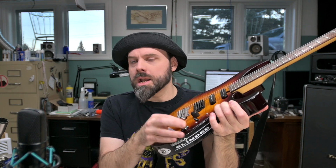I would like to think that Seymour Duncan could program it in the software to pick a spare position, maybe in an advanced settings, and connect that to a switch. It can detect, say, the lack of signal or a ground, right? Maybe that channel just detects that there's a duplicated signal where there's not supposed to be any signal. It doesn't route that signal into the mix, but it recognizes that as being switch on, but then it can detect if that signal's grounded out. And then it knows you flick the switch, and it knows to select between 2 different profiles.